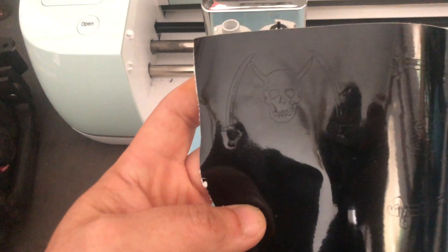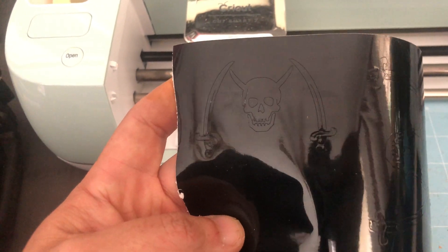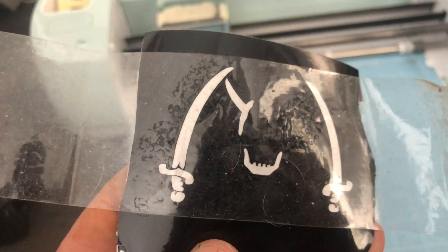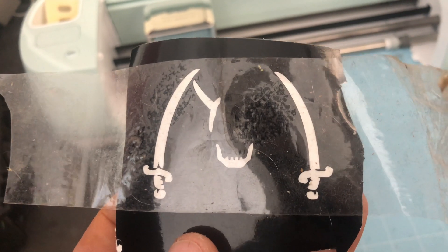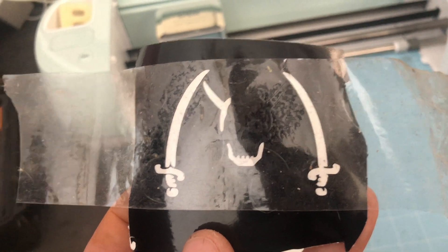Here we have a completed cut template for the sticker, and I'm going to be putting this on one of the blades — etching it right into that aluminum. To visualize where I'm sticking it, I peeled off a couple of pieces I know will be exposed: the eyes and the nose. For transfer tape, I'm using packing tape that I've stuck on my shirt to pick up some lint and make it less sticky, so it lifts the vinyl without adhering too aggressively. You can also use masking tape for this.